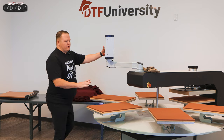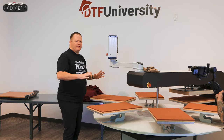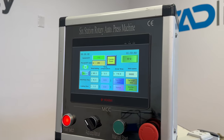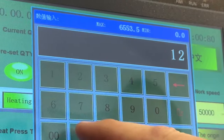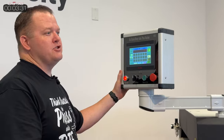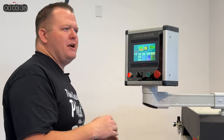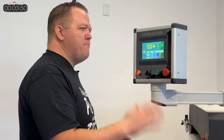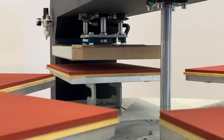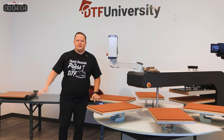Those are printing. I'm going to come over to our Lightning Press, our six-station heat press. We will have a video going more in depth about setup and adjustments, but for right now I'm just going to get it going. We want to do about 260 degrees Fahrenheit, which is about 126 Celsius. Before you comment that that's too low — our shirts are 100% polyester, so we want a lower temperature to avoid burn marks. Our press time is about 20 seconds, but with a four-second gap for the press coming down and back up, we're going to set the timer for 24 seconds. We'll leave it here and let it heat up while we wait for the prints to finish.